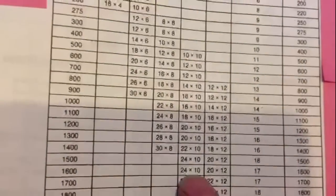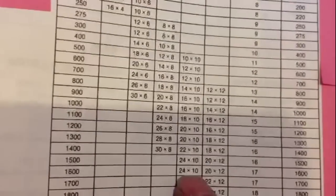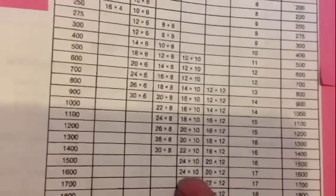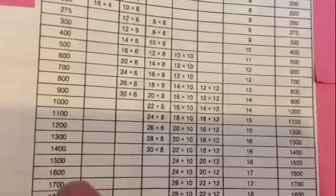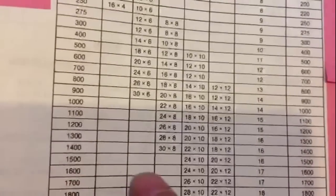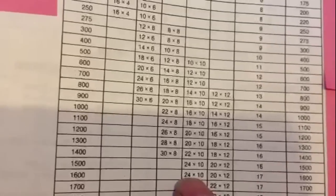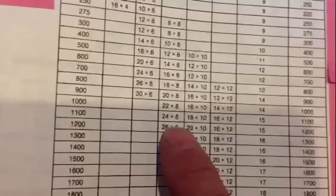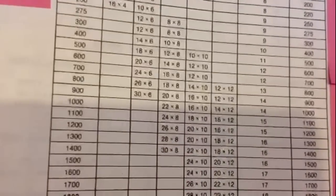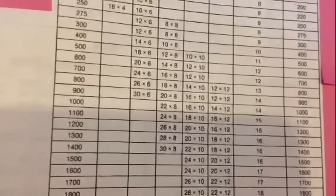At that point you're going to need to use a 24 by 10. That's what I recommend for a 100,000 BTU furnace. Some manufacturers recommend 2 return airs, so you would need two 24 by 8s. The bigger the furnace, the more ductwork you need; the smaller the furnace, the less ductwork you need.